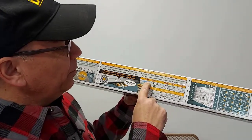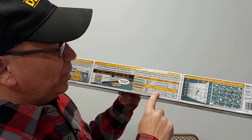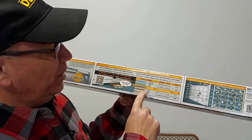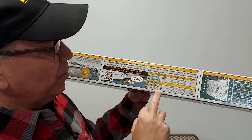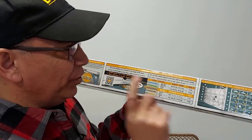If you have a door that is 155 to 165 pounds, it'll be painted brown on the end. For the large doors that weigh 175 to 185 pounds, the spring will be painted gold. And that's how you choose which spring is the right tension for your garage door.